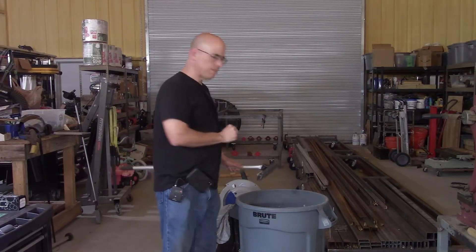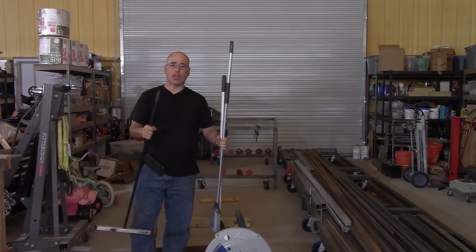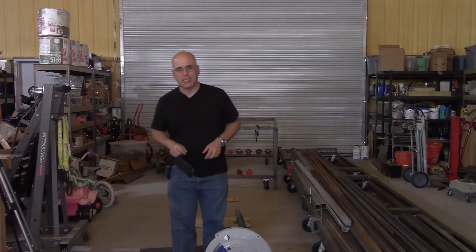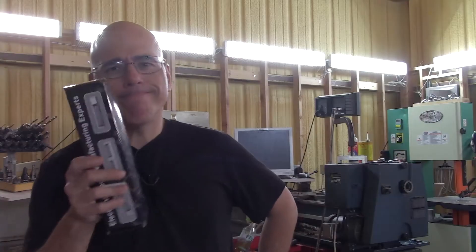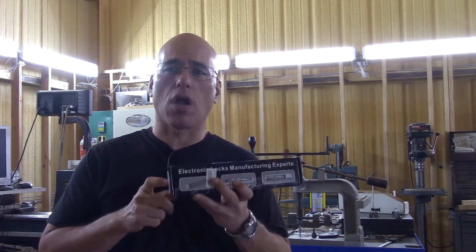Let me check out something — hey doc, am I up to date with my tetanus shot? You may want to use a glove for this part. So brooms, vacuum cleaners, magnetic pick-it-overs — these are all great, they work. But I'm going to let you in on a little secret: a few decades ago something amazing happened, it's called the 21st century. I think we're due for an upgrade. If only I had some sort of contraption in which I could control its magnetic field by passing a control current. Today's project is basically going to be an electromagnetic door lock which I'm going to control using a PAC5526 configured as an H-bridge, regulating the current so I can control the strength of the magnetic field — allowing us to pick up chips and then release them into the trash can without needing a new tetanus shot.